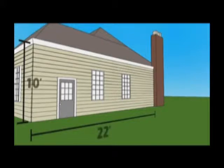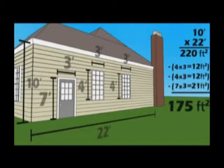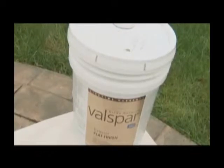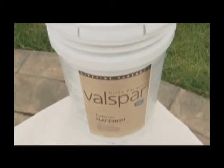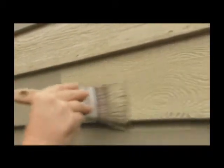To figure out how much paint you will need, calculate the square footage of each side of your house — height times width minus the doors and windows. Typically a high quality paint will cover about 400 square feet. If you need help, visit lowes.com/calculators. If you need five gallons or more, you can buy paint in five gallon buckets at Lowe's. Make sure you buy enough to paint in two thin coats, as one heavy coat might cause problems you will have to repair later.